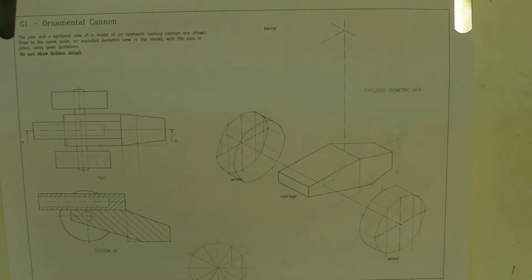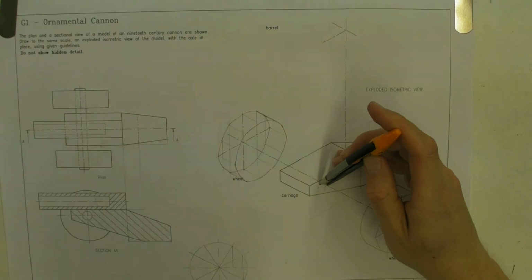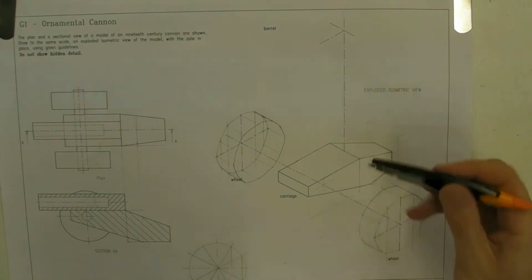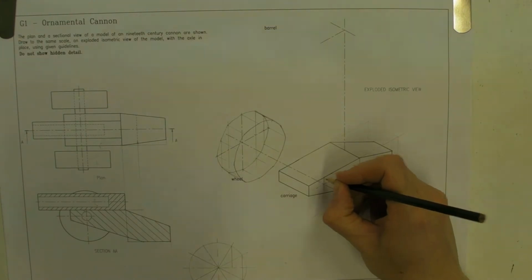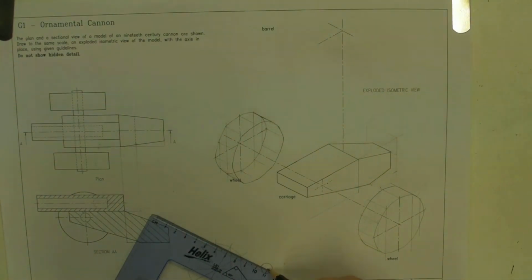Now, it's an isometric circle, it's an isometric hole, so we're going to measure the size of that, and we'll mark on the sizes here. Here, here, and here. Okay, so we know what size we're talking about. And we should really draw a little circle and then do some generators for it. So as careful as you can, draw a circle, and then you divide it up using your generator just in the normal fashion.